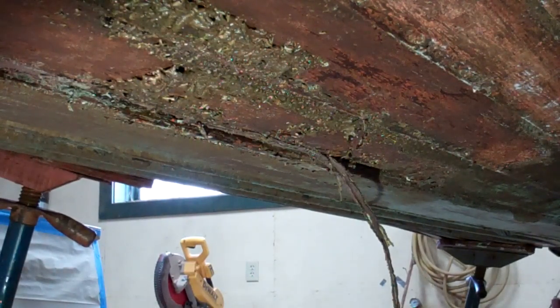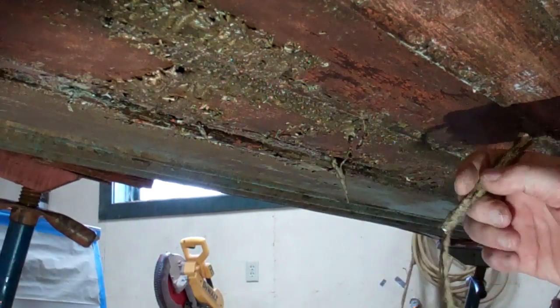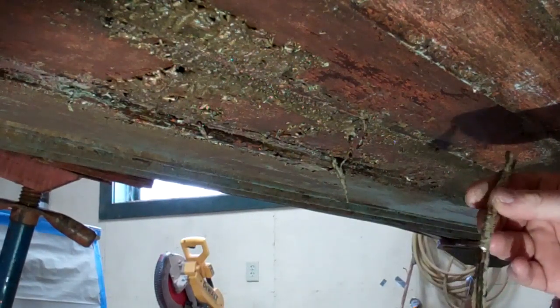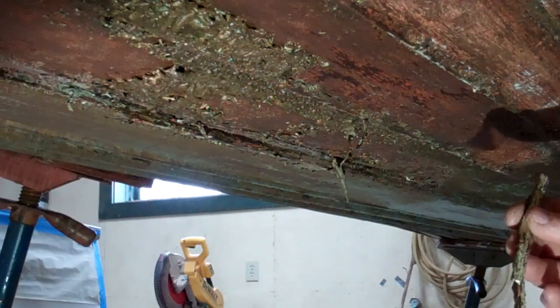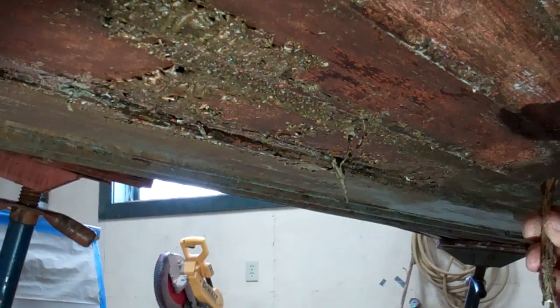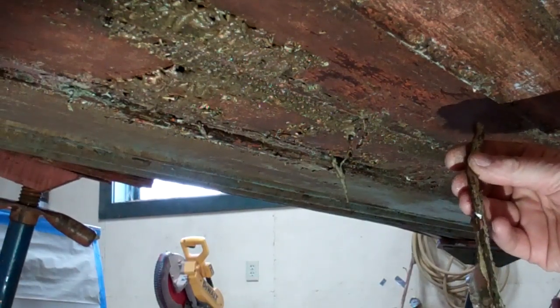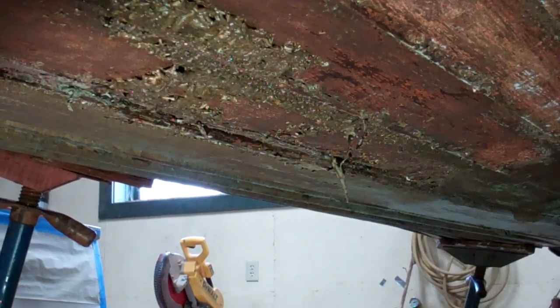What was interesting to me, because my wife and I are also sailors, and we used Boatlife Caulk as a bedding compound on our sailboat, no more, because Boatlife Caulk flunked Practical Sailor's testing. Its adhesion began failing before the end of the first year of the 3-year test, and had totally failed soon thereafter. So, Practical Sailor's conclusion with respect to Boatlife Caulk, here we have it. Don't use it. It won't stay adhered, and it certainly hasn't here.